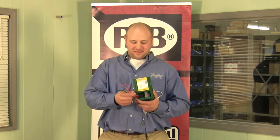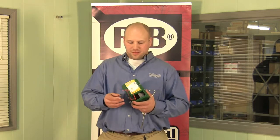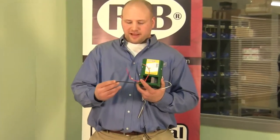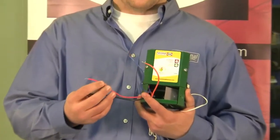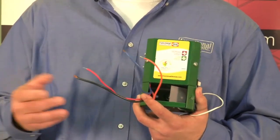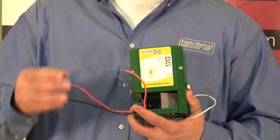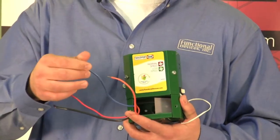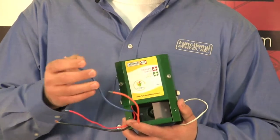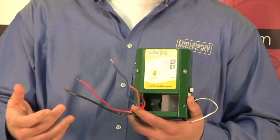What I like about the ESC is that it's very easy to wire. The input wires are the red and black here. Black is your switched phase and red is your neutral or second line. It detects whether it's 120 or 240, and then depending on the type of motor you have, the blue wire is your output for your PSC or shaded pole motor, and the green wire is for your ECM two-speed motor.